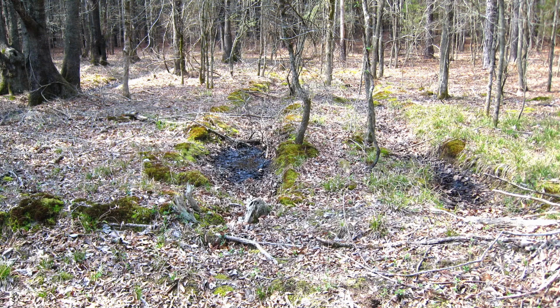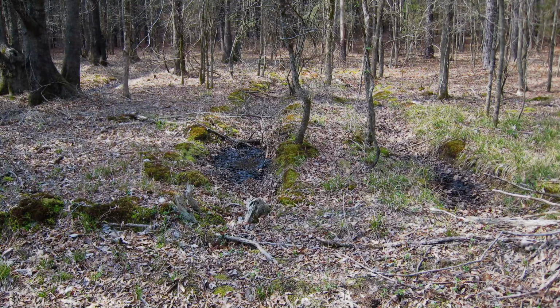Some people think that all you must do to make a wetland is to excavate a depression in the ground. This rarely works because plants will drain the water in the basin, their roots will penetrate the soil, the freeze and thaw action will crack the thin layer of compacted soil, and the periodic wetting and drying will also crack any clay that's present in the basin.